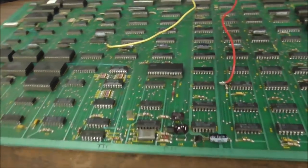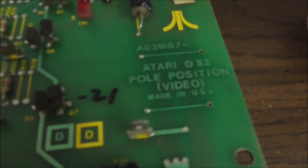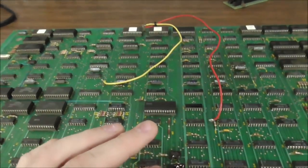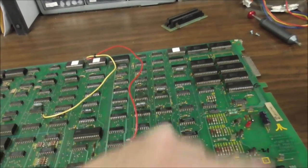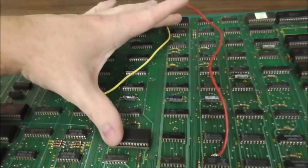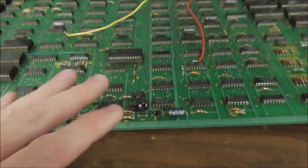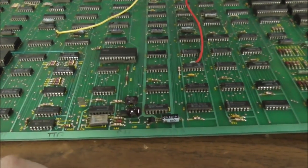I want to make it where it's completely removable from the cabinet. I don't like whenever people just solder stuff to the game and it can't come out. So this is the other board — I believe this is the video board. The two boards connect together with this end connector. I don't know if it has its own separate power that comes in here or if they route it all through the end connector. We can look on the schematics and figure that out. On this board you've got custom chips again. You've got 2016 RAM, but they're socketed so that's cool. And up here these are just ROMs. You don't have the battery damage problem.